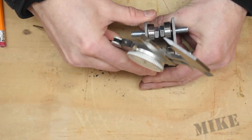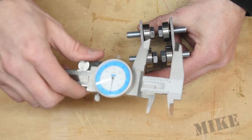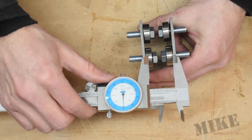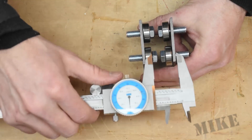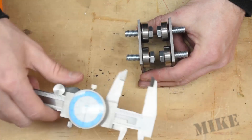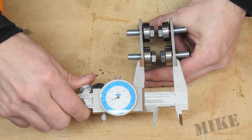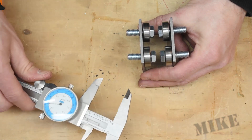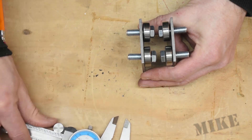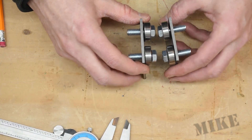I'm going to have to grind them a little bit, because I've got to allow at least an eighth of an inch for the web, and I want full bearing contact — I don't want half the bearing hanging off the bottom flange. This here gives me about one and a quarter inch. So each of these bolt heads will have to be ground down quite a ways, but that's not any big deal — I've definitely got equipment for that.